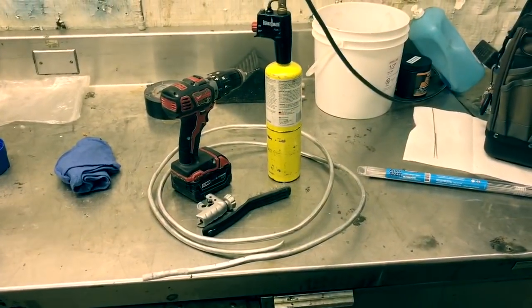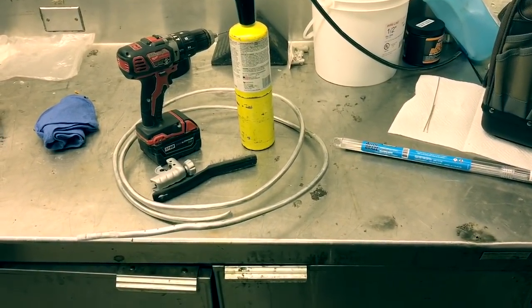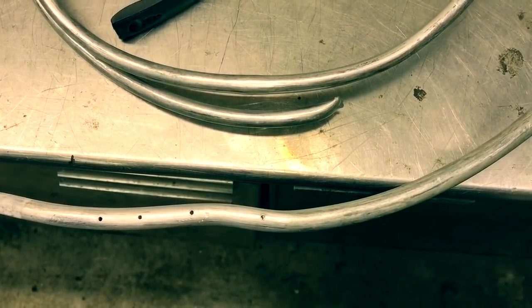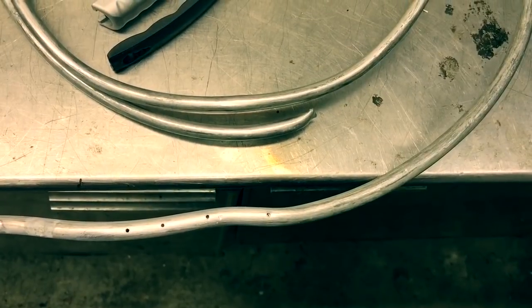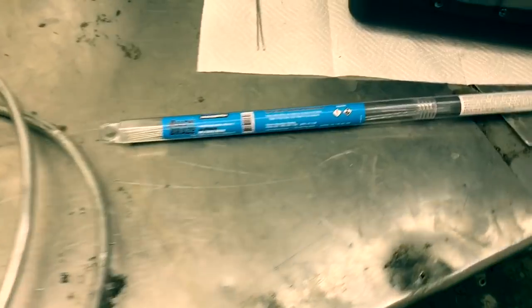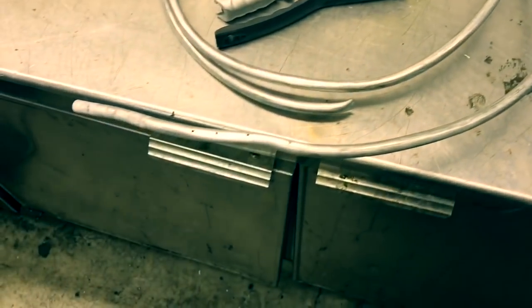Enough blabbing — let's get to it. Here's my work area set up to experiment and try laying some of this rod on some pilot tubing. I went ahead and drilled a couple of holes — we'll try to fill them in, making them a little bigger than I normally see on a coil just to test the limits, kind of simulating a zip-in screw getting shot into a coil by accident. We'll be trying it with map gas. I cleaned it up with a wire brush, and we'll go ahead and try to melt the flux first before applying the rod, so we don't damage the aluminum.